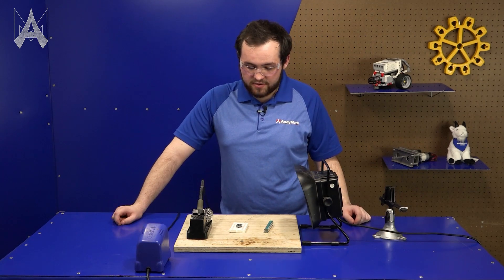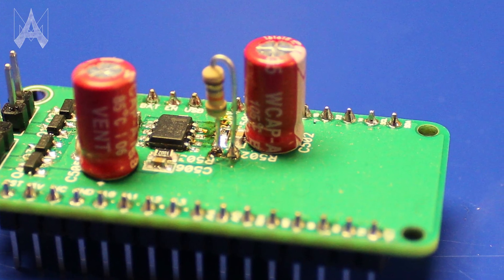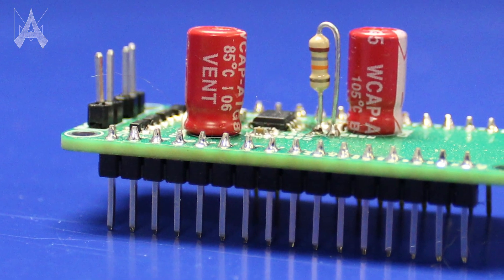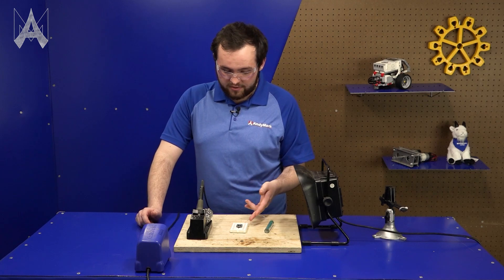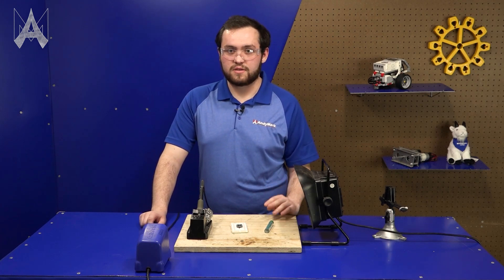The right amount of solder can be tricky. A lot of people use too much or too little solder. You know you've got a good solder connection when it soaks through both layers and there's like a teepee shape. You don't want just a solid ball — that actually means you have a cold solder joint or too much solder, and that's not structurally or electrically sound.